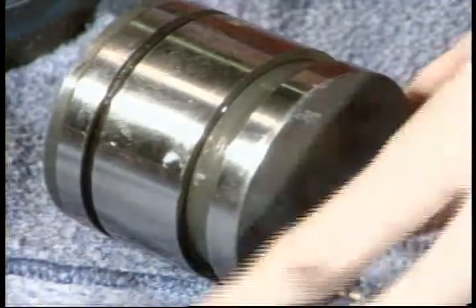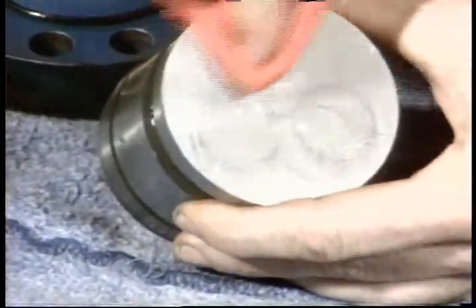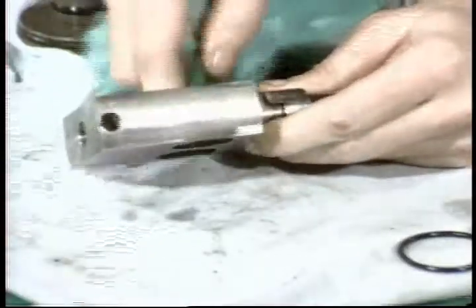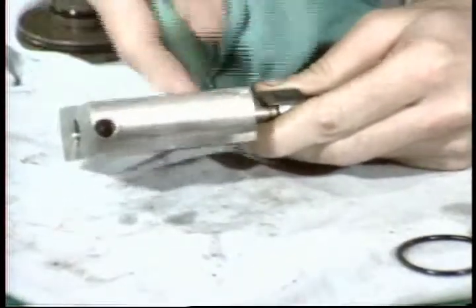When you clean the valve parts, be as thorough as possible. Clean every seal surface, ring groove, flange face, bore, etc. Use a solvent or diesel. Even soap and water will do.